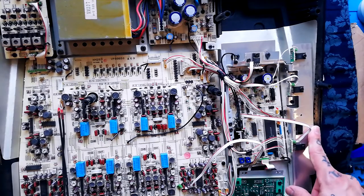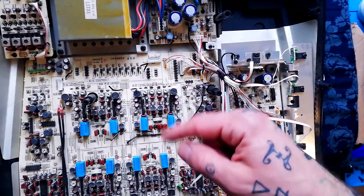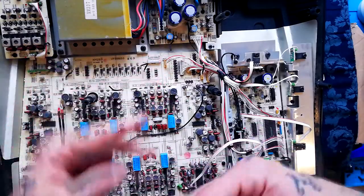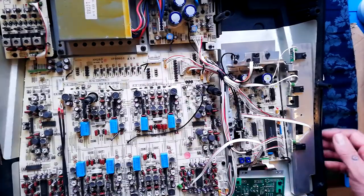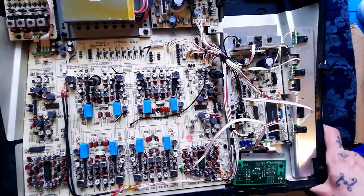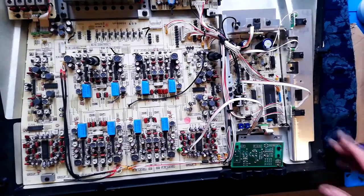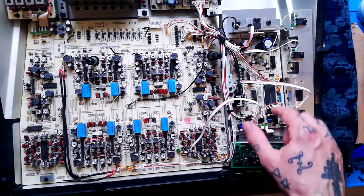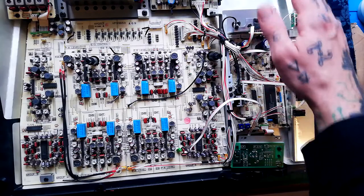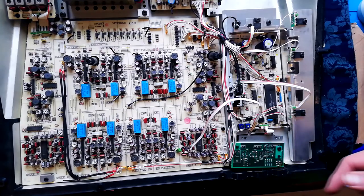I'm not exactly sure what the operational amplifiers run on on this — I've seen values between 9 volts and 15 volts depending on the system. There'll be a positive and a negative rail, because the operational amplifier is working on AC, so you need to have a positive and a negative input at the same level of DC so it can create voltage swing. That big giant board has got all the control logic, or at least some of the stuff to do with making the motor respond to the control logic.